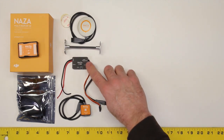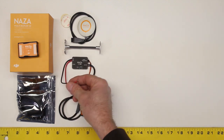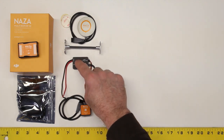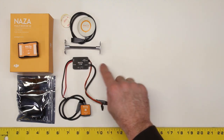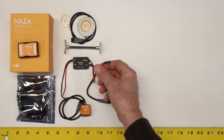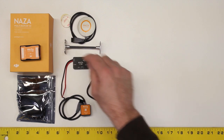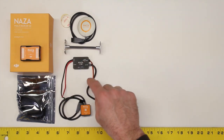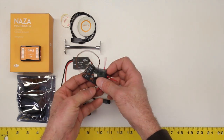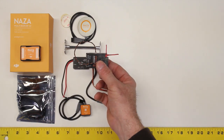Next in the box would be the Naza's PMU — that's the power management unit. On one side you have a red and black wire; those get powered directly from the batteries. The Naza can take anywhere from a two to a six-cell battery pack. Inside this PMU it regulates that power down to five volts, and with this wire, which goes into the X3 port on the side of the Naza, it provides power both for the flight control as well as the receiver for your RC system. So battery power in one side, five volts out the other to power the flight control and your receiver.